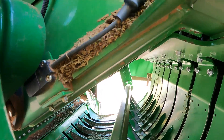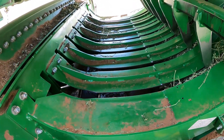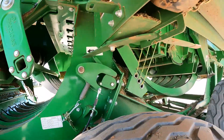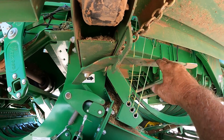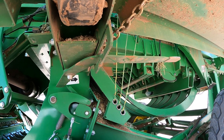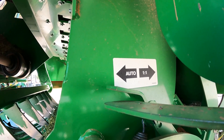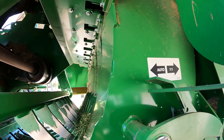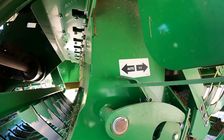What they mean by not filling is that it's not picking up hay and filling the pre-chamber. When you're running this baler in auto, you've got a lever underneath your left side twine box. This lever can be pushed inward or pulled rearward to put the baler in one-to-one or in auto. Right now the lever is pointing forward, which puts the feeding system in auto.